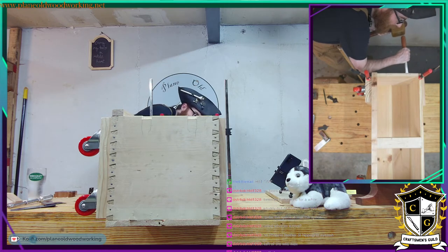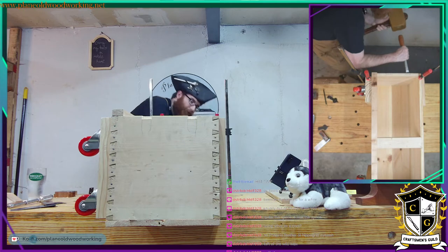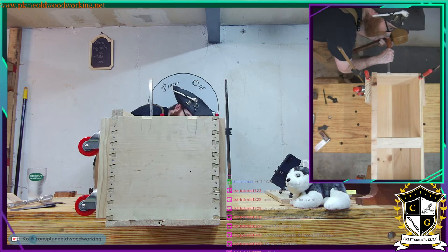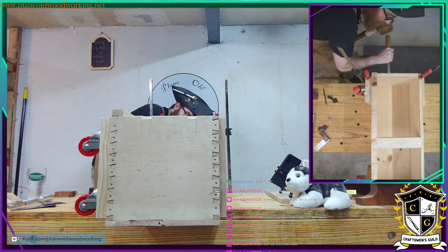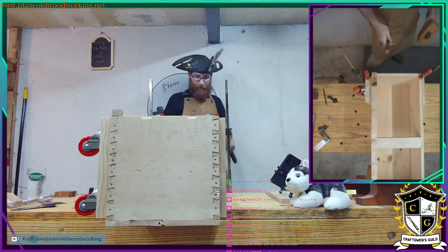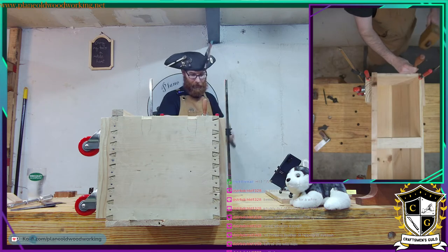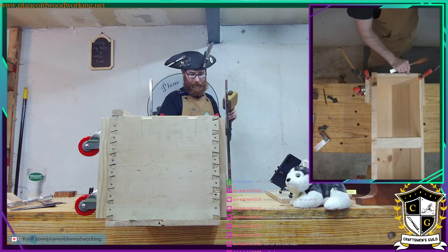Normally when you're setting hinges, you do a lot better job than what I'm doing right now, but since this is kind of an archaic tool thing, there's no reason to bring out the router plane and get everything to the gnat's ass. We're just making clearance because there's this big quarter inch deep barrel that needs to be recessed in.